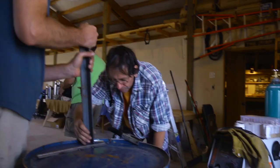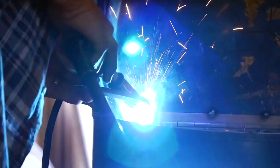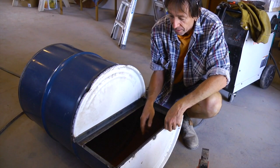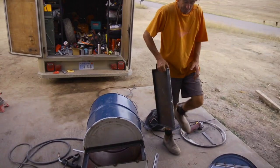Tim's design is freestyle as we go — a broad arrangement. Since this is the first time, he's not being too hung up on planning it all through. With a six-inch rocket stove inlet, the top of the heat riser will come in here, so the heat will come up through here. A griddle or hot plate will sit in here, applying the full heat of the six-inch system — a reasonably heavy-wall hot plate for good heat reserve.